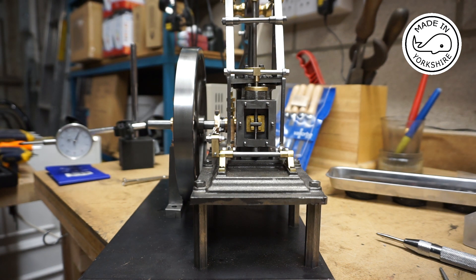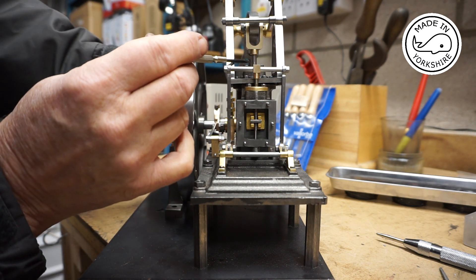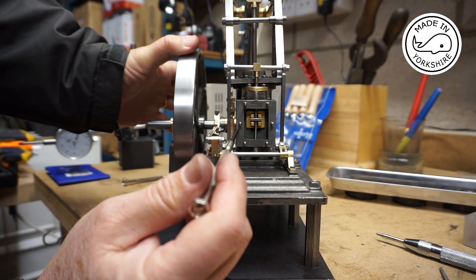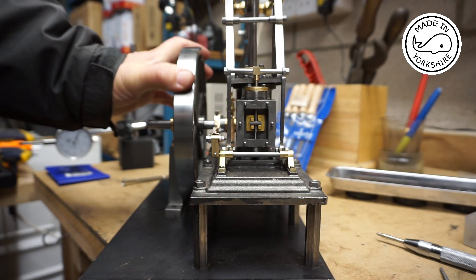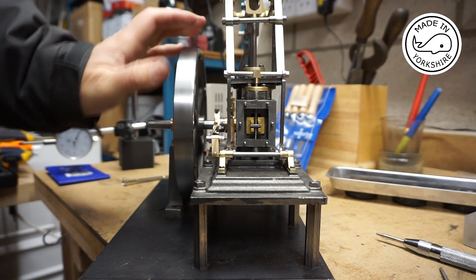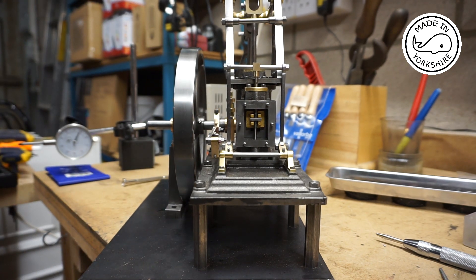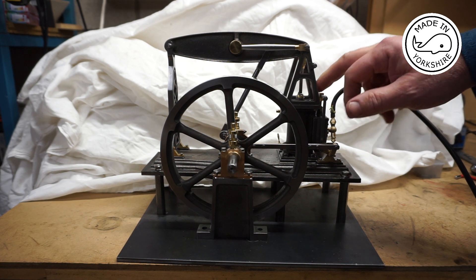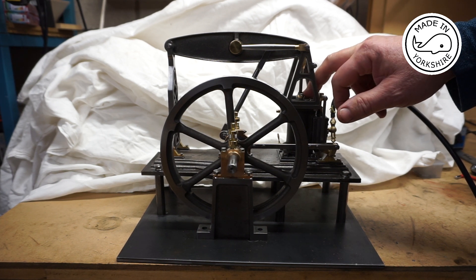Okay, so after a bit of fiddling around I think I've managed to do it. I bring it down to bottom of stroke and as the piston just starts to rise, we're just getting this port exposed here, which is good. Now if we go to top of stroke and as it's just coming down there, we're just getting that to expose. I think that's pretty close, so I'll put the valve chest on and we'll give it a bash on air. I've put most of the gaskets on and I did a test run and there was loads of air leaking out of where the piston rod goes into the cylinder. So I've put some more gland packing in there. So we'll give it a bash.